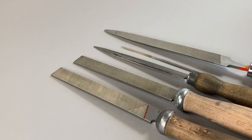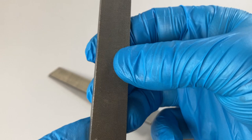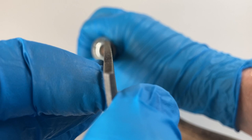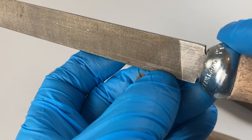The second file is very similar. You can see that these files taper in thickness — they're thicker near the tang than at the end. It's always worth looking along the length of the file to see whether it's straight, as they sometimes distort during the hardening and quenching process. That slight convex surface is actually useful when filing flat surfaces — we don't want the file to be dead flat. Like the first file, this one is double cut, but the teeth are slightly coarser. This is a zero-cut file.